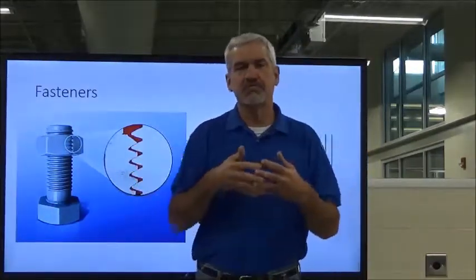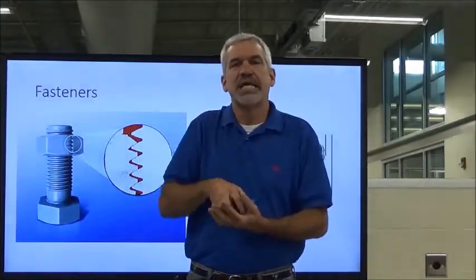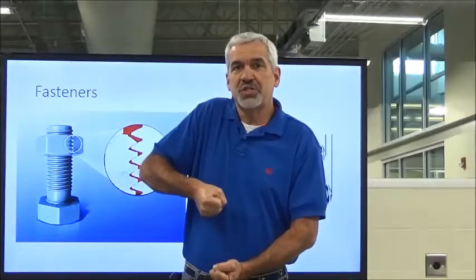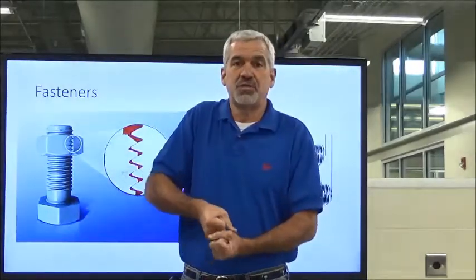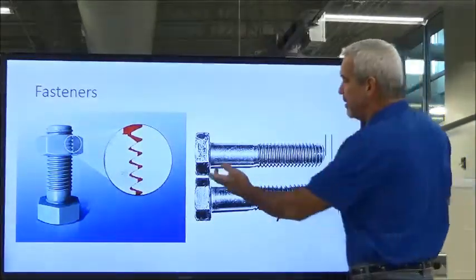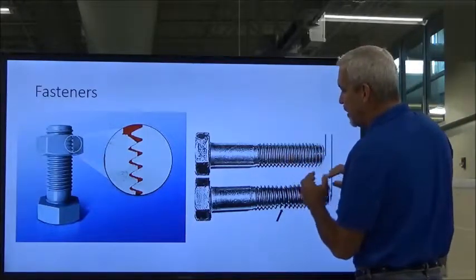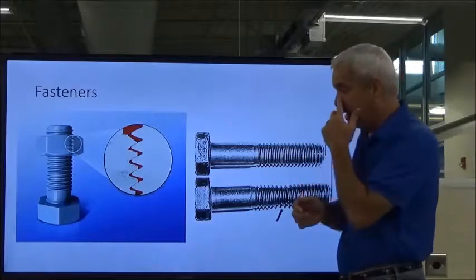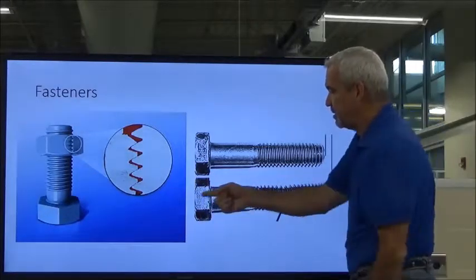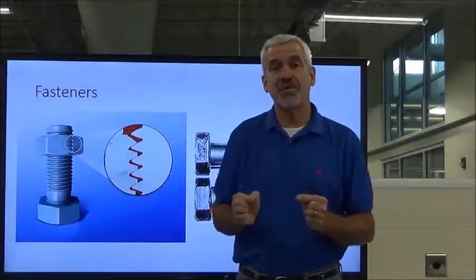These have to mesh, but there's more to it than that. When you have something bolted together — two pieces of steel with a bolt going through — the idea is that we want to put a tensile strength, a stretching force on that bolt, so we are actually literally stretching it. That's what the bolt is designed to do: to be stretched so that it can provide a pressing force, a compression force on the material that we're assembling. We've tightened that nut down to a certain torque value, and as a result we've stretched that bolt and applied a great tensile strength along the axis of the bolt shank.